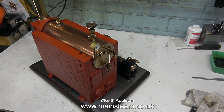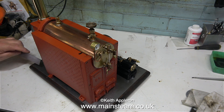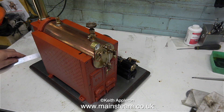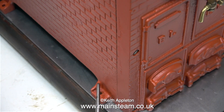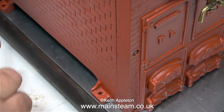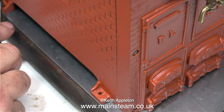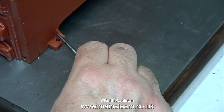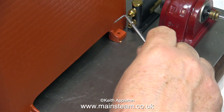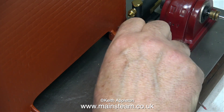For instance, I figured out that the rear mounting lugs need to be very close to the end of the piece of metal. Some people watching may wonder why I'm going to so much trouble to mount the components on steel rather than just painting the wood, filling the holes, and using small wood screws. But that would be very poor. I never like to mount steam engine components to wood because wood expands and contracts with heat, and it moves about. This is the way to do it — make sure you have a really solid mounting base.